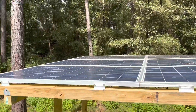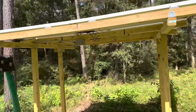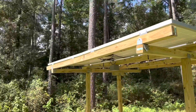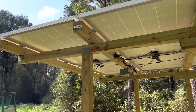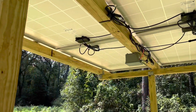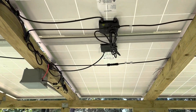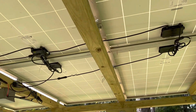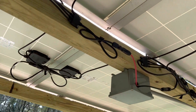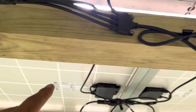There's a total of six panels, so you're looking at $300, and with shipping and delivery it was a total of about $650. The way I hooked this up is in series - these two panels in series, these two panels in series, and these two panels in series. That makes three strings, and those three strings are going in parallel. When one of the strings comes in here it goes into a combiner that has four connections but one is not being used.